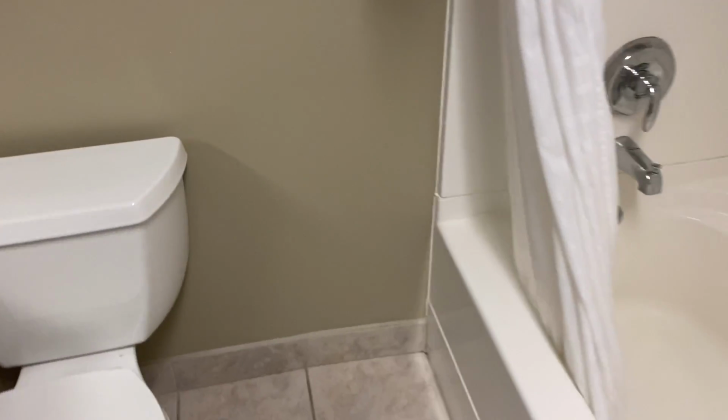So somebody probably had their mud mixed way too thick and just didn't wipe hard enough or long enough, and then pretty much didn't even sand. So not that nice. And moving on here at the bottom, we can see what happens when you don't shim out your tub surround flange.